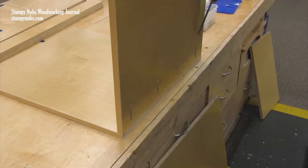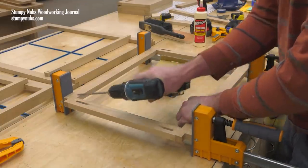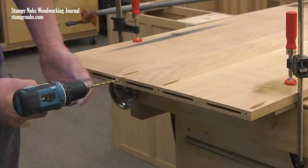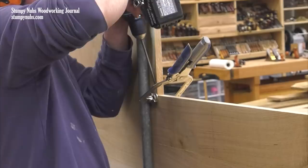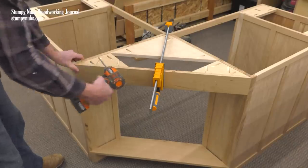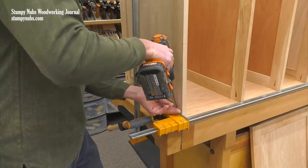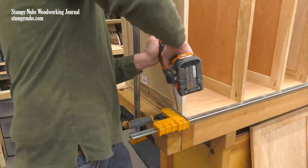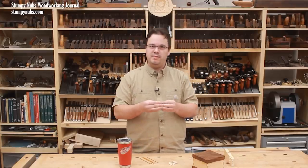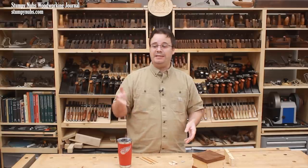But I love pocket screws for casework, including cabinet boxes and face frames for built-in bookcases. Pocket screws are also very useful for solving difficult problems — many times I've been able to slip a pocket screw into a tight spot to create a joint where conventional joinery would have been difficult or impossible. Pocket screws also allow for some wood movement, which makes them useful for attaching wood tabletops or other cross-grain joinery. They're wonderful for projects you may wish to disassemble and modify at a later date, because they may be used without glue. And perhaps my favorite thing about pocket screw joinery is that no clamps are needed — in fact, I've used pocket screws in place of clamps to hold projects together while the glue in the conventional joinery dries. Admittedly, pocket screws come with a big downside: unlike dowels and biscuits that are concealed within their joints, a screw pocket is unmistakable. They may be plugged, but unless you plan to paint the project, their locations must be carefully hidden through planning.